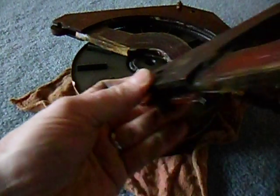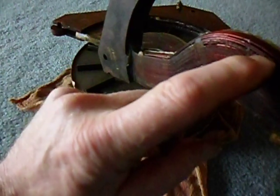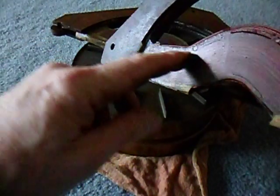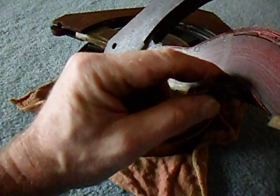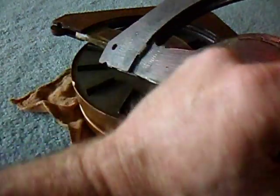We also had a question about the way these coils were constructed, and I've got a couple of different types here. This one is wound with just regular fine-gauge copper wire, and the turns just continue to loop around and they build up the thickness. It looks like they're going about six turns deep and probably 30 turns coming this way, if I counted right — so multiply that out and that's how many turns you've actually got.